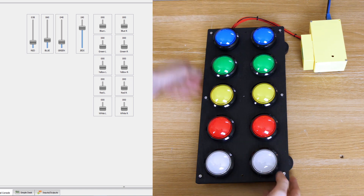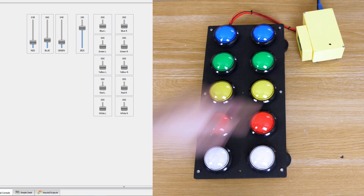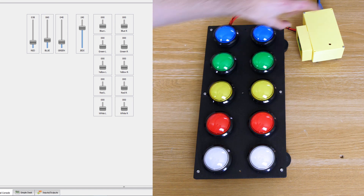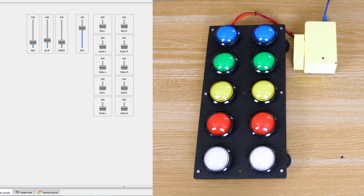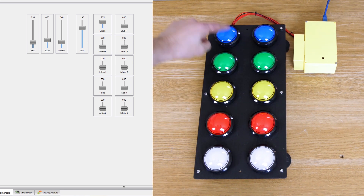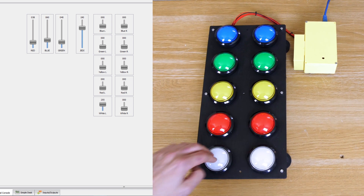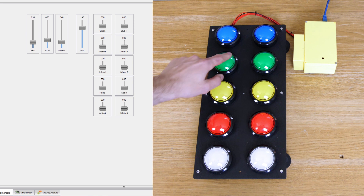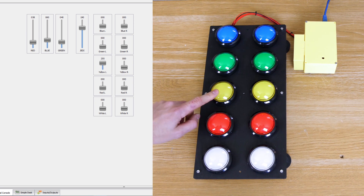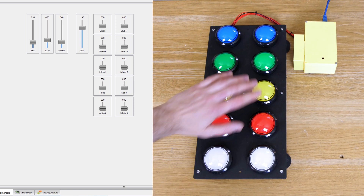I've got one more interface: pinball machine buttons mounted on a piece of wood with rails and rubber feet. Again there's another Arduino in the box, and this one isn't doing very much because these are just switches. I've got a little expansion port on the side that I'll eventually plug more switch interfaces into — they'll all share the same Arduino. In QLC Plus, these have some functions: at the moment I've mapped them to faders that go from 0 to 255 when you press them. I thought it's more useful to have an actual full swing of a value that does something, so all the buttons are set for 0 or 255 in code on the Arduino, and that value is transmitted over with unique OSC messages.